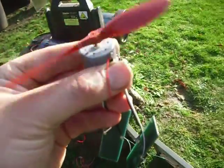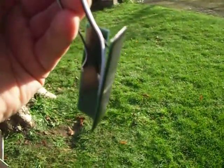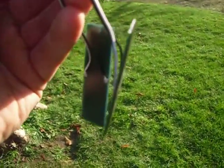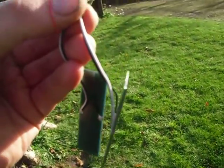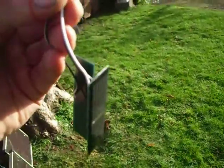And it's simply because I've wired the two solar panels back to back, and they're single cell panels, which is just as well, because when one panel's in strong sunshine, the other one sees its voltage backwards, and I think with single cell panels it's more reliable that you don't damage them.